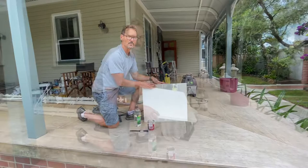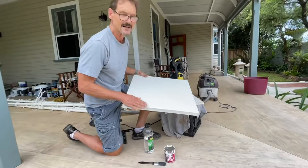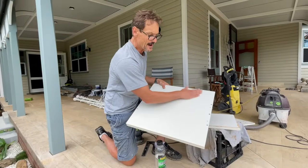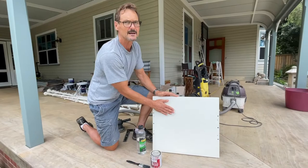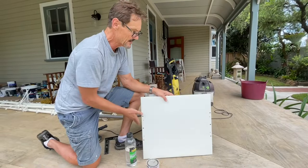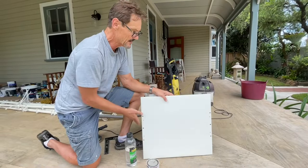The finish coat over the shellac can be an oil-based or water-based product. This board here has an enamel finish brushed on — you can also spray or roll the finish for various quality levels. There are DIY two-pack finishes and water-based two-pack finishes which I believe are excellent. In this instance I'm using an oil-based enamel which finishes quite hard and is suitable for these shelves. They've come back completely flat and nicely finished. The trick is: get it flat, get it sealed with shellac.